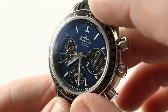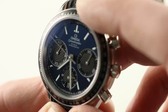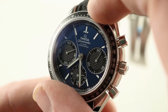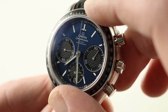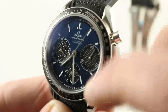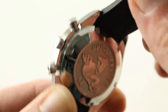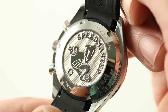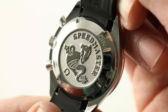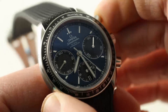The reason is because this is caliber 3330, which is a Valjoux 7753 converted and, I must say, remarkably hot-rodded. Fundamentally, what the 7753 architecture does is it turns the 12-9-6 orientation of the counters on a 7750, so they become a standard balanced 9-6-3, and that's what we have here. That's why you lose the quick-set for the date, but you still have the hacking seconds function. You have quite a few functions. Turn the watch over, and although you see the hippocampus or seahorse, there's a lot going on underneath that 100-meter water-resistant case back. You have a caliber 3330 with 52-hour power reserve. The 7753 has been converted from a cam system to a column wheel, so the action is chunky and very crisp.